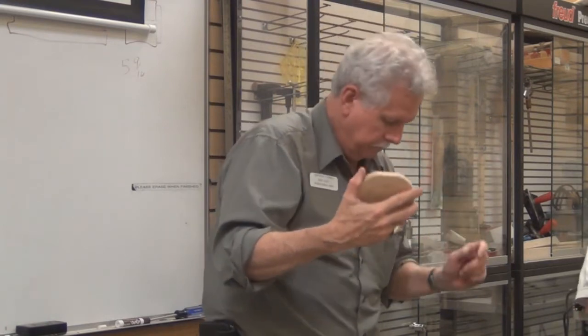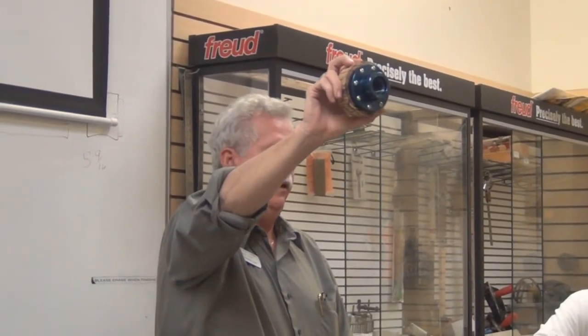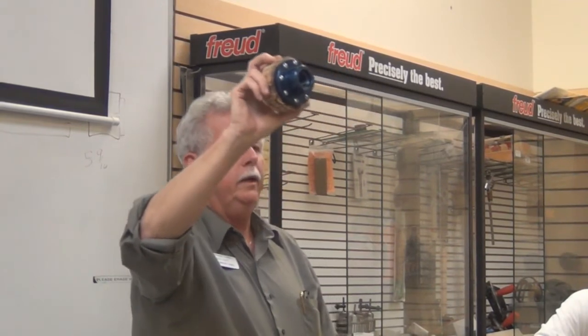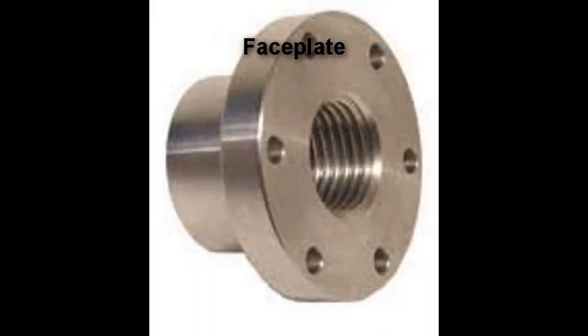Face plates. It's got eight holes in it, it's got eight screws in it. If there's eight holes, put eight screws. I don't care how big, how little, how heavy, how soft the wood - eight holes, eight screws. Some of them have four holes - drill some more holes, that's the best answer. Because four holes just isn't enough, especially if you're turning wet wood. If you're turning dry wood, it's probably pretty expensive - you probably don't want to waste all that thickness. This just came out of the burn pile, so I don't care how much I'm going to waste. Eight holes, eight screws.